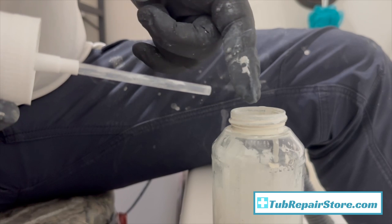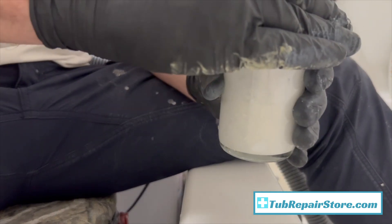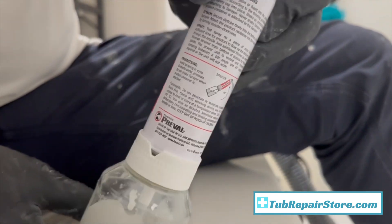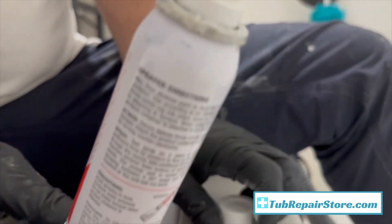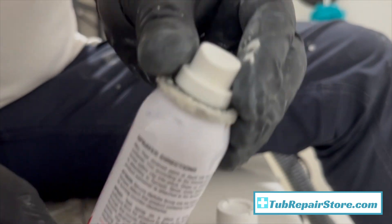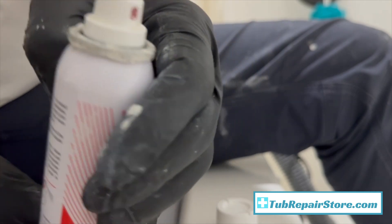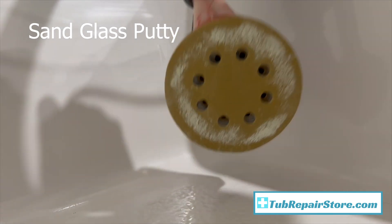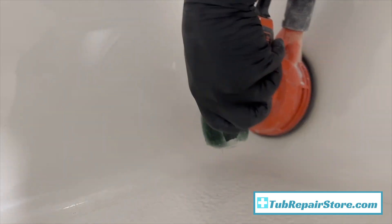I always pull off the filter cap on the pre-valve - I've found it's more prone to clog if you leave that filter cap on. There's also a vent hole on these pre-valves, and you always want that vent hole facing back towards you, especially if you're spraying down on the floor and tilting the bottle. That way it's not going to leak whenever you tilt that jar forward.